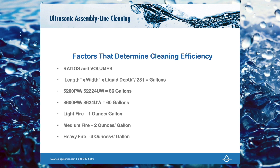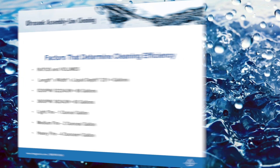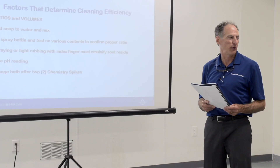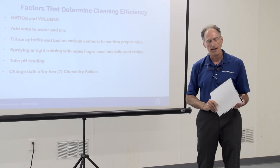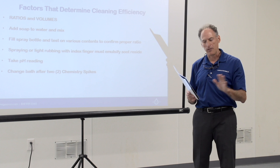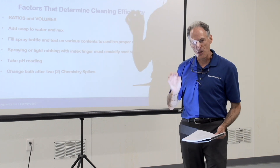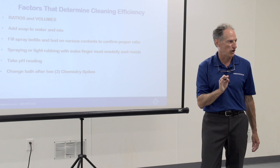For a medium fire, start with two ounces of soap per gallon of water. For a heavy fire, probably start at four ounces per gallon — and that still may not be enough, so you always have to test. In the ultrasonic restoration workbook on page 10, it breaks down exactly how many gallons of soap you need. For a medium fire at two ounces per gallon in a 5200 system, you're adding about a gallon and a half of soap. All of that math is on page 10 — it's a starting point, not a guarantee.